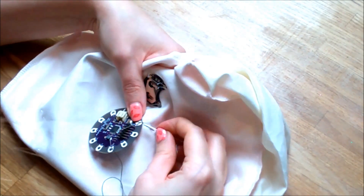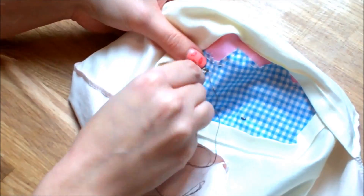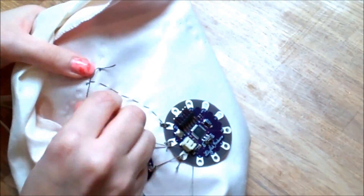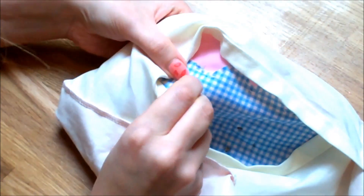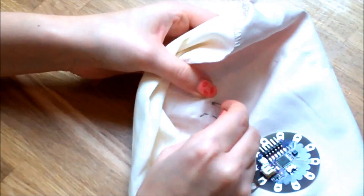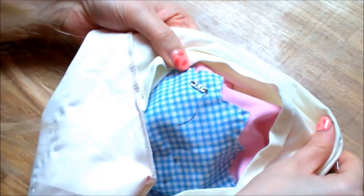So we've done the plus on the LED to a numbered pin on the board. Now what we need to do is connect the negative on the LED to the negative on the LilyPad board. Sometimes we have to get a bit creative with this — you'll notice when we put in more LEDs how we're going to connect that, because we cannot have the conductive thread touching or crossing each other's paths, so we need to sew a path every time that's individual.